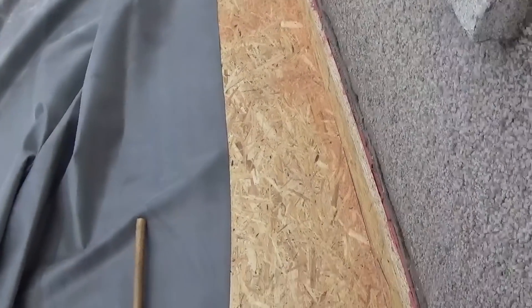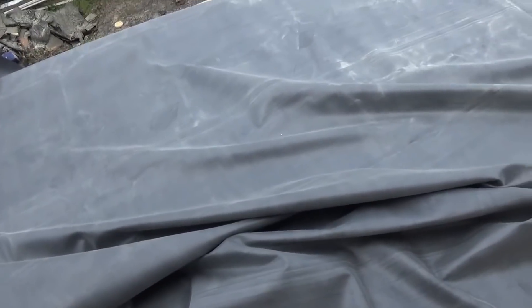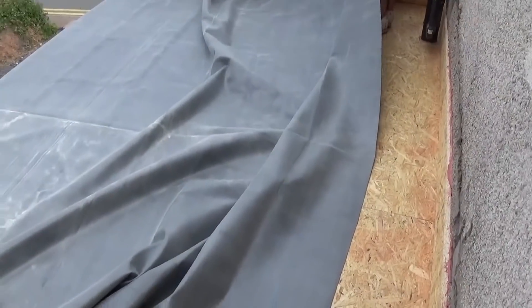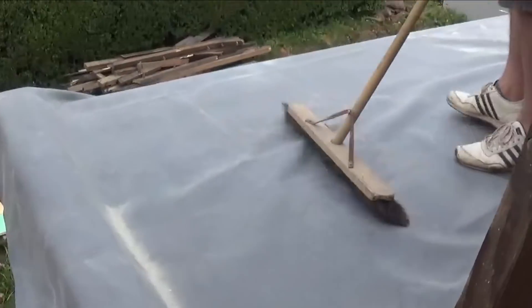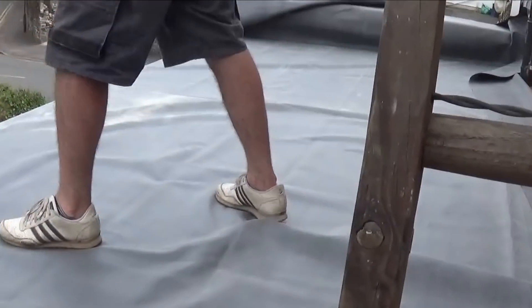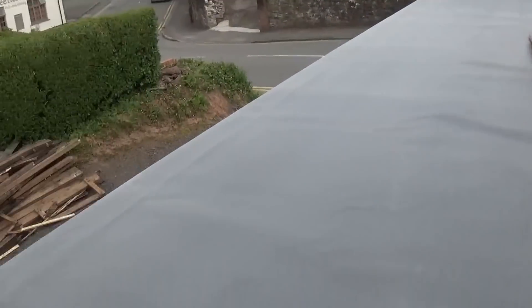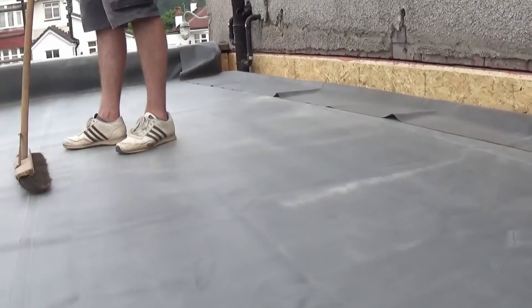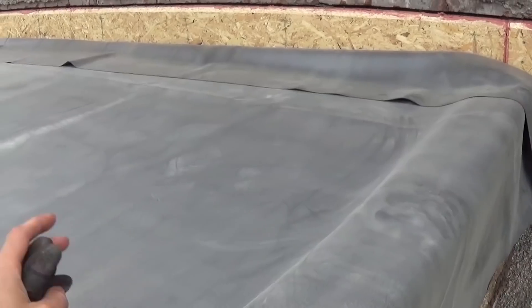Before you lay your rubber down, you need to make sure the roof is all swept nice and clean, then hoover over the top so there's no dust or debris on it. Then get your rubber, lay it out and let it settle across your roof, brush it out to get rid of the creases, so it's flat all over the roof and in the place you want it. Then roll it back from one side to halfway, apply the adhesive, roll it back on using a brush, stick it down, and do the same for the other side.